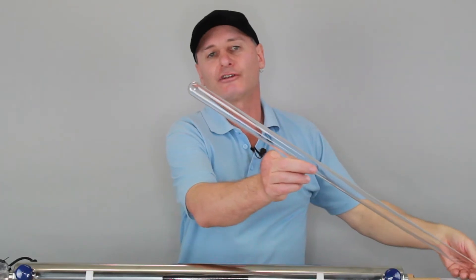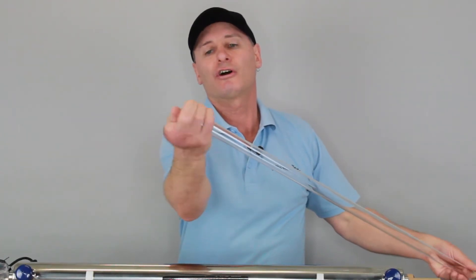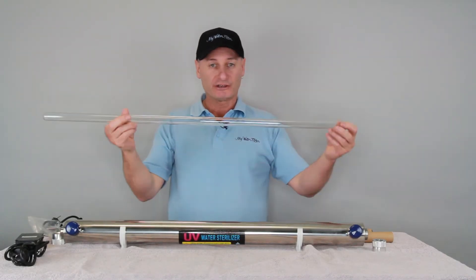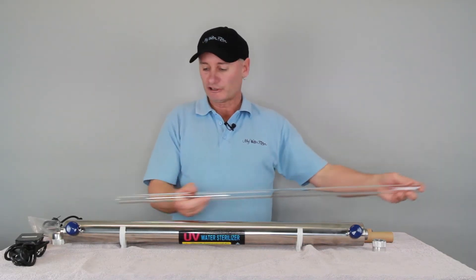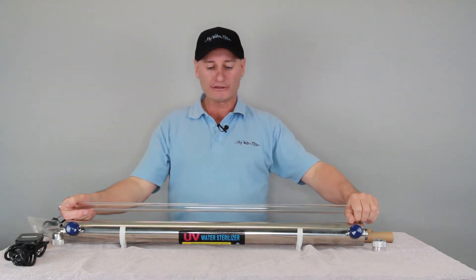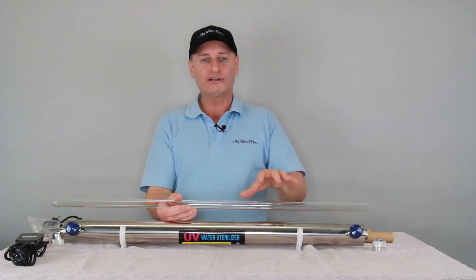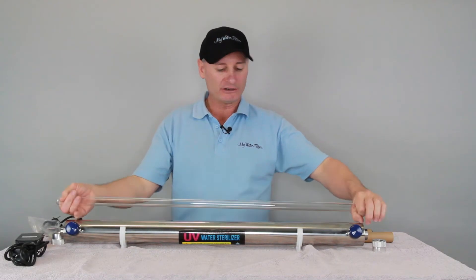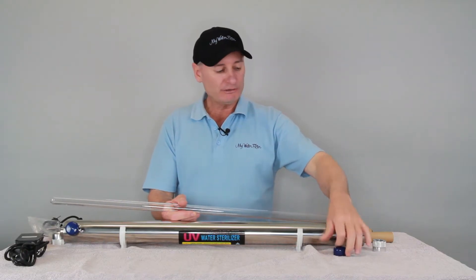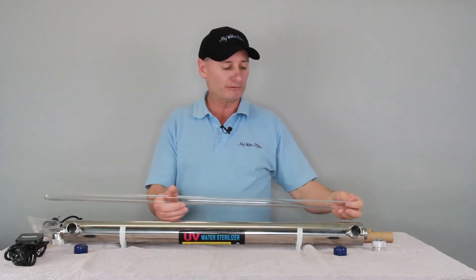This is the sleeve — the glass sleeve, or the quartz, or the thimble. Normally I try not to get my hands on this, but for the benefit of today we're gonna give you a good look. There's just a nice smooth end so nothing's gonna leak out of there. Do be careful — you just don't want it to crack and break. That thimble is gonna be slid down the inside of this system and we're gonna seal it on both ends. Once sealed, the water cannot get inside the glass and cannot get out either end. The water's locked inside this housing by the two O-rings on the end. Water's coming in — you've got BSP one-inch inlet, BSP one-inch outlet, so it's a good high-flow volume: 46 litres per minute for the whole house.